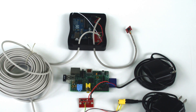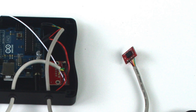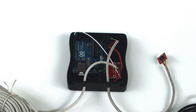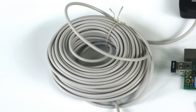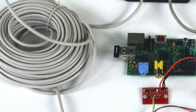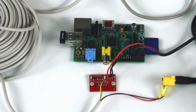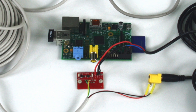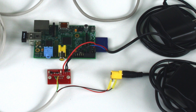Here's the system. At its heart is a two-axis magnetometer, a little breakout board from SparkFun, which is attached to this Arduino Uno on the blue circuit board at the left. At the right is a level shifter board. The data is sent at RS-232 levels over this 50-foot length of telephone cable to another little red level shifter board, which in turn shifts it down to 3.3 volts for the Raspberry Pi. The Raspberry Pi is connected to my local area network wirelessly and broadcasts a webpage showing the water usage.